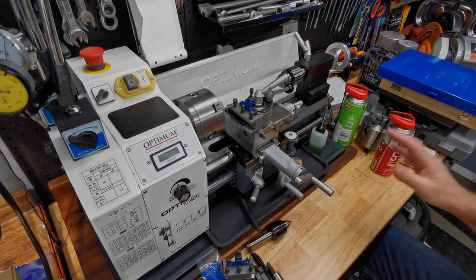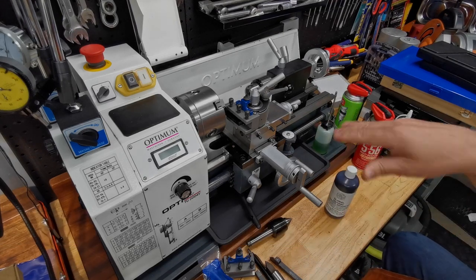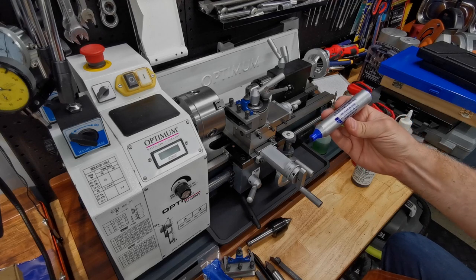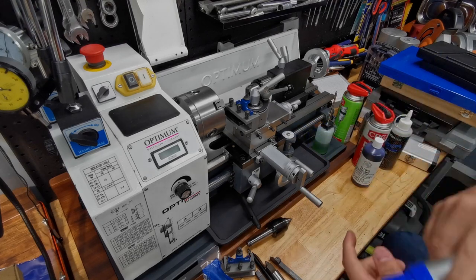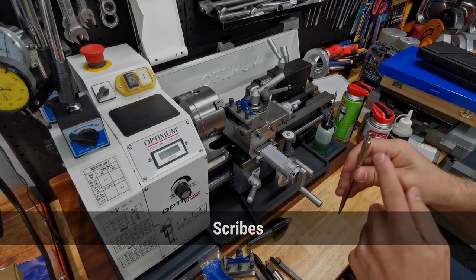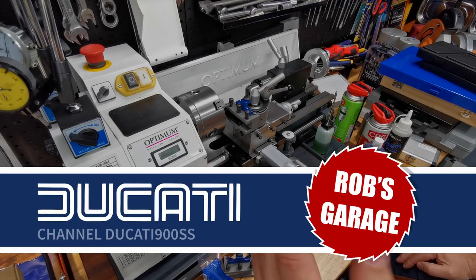Engineers marking ink takes a little while to dry, but once it's dry it really stays put — use that when marking up a part for many different cuts. If you're just making a quick mark, these cheap blue markers from the dollar store are great. Just be aware it comes off with your lubricant and with your fingers. Scribes: I like the single-ended one because the double-ended one means I keep sticking myself with it. I think that covers everything — thanks for watching, like, subscribe, comment, ask me anything.